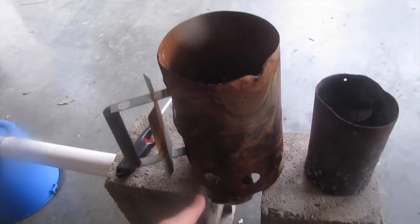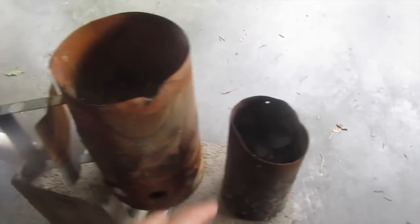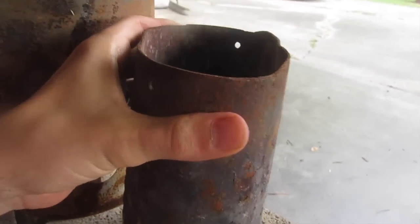So this is what you need to melt aluminum at home. First, you need one of these chimney starters that you use to get charcoal hot for a barbecue pit. You need some kind of steel container that's fairly thick and won't disintegrate too bad as it gets super hot. This right here is an old steel fire extinguisher — I found those to be the best. There's a local fire extinguisher repair shop that throws old ones out all the time, so look for that in your area.